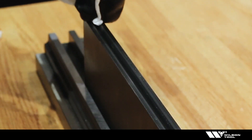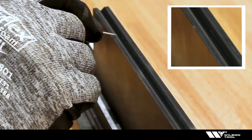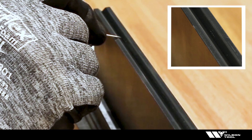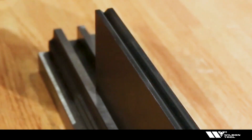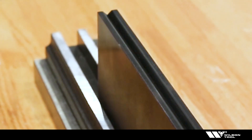We're still left with a little bit of buildup. That one spot can be taken away with our lightest scotch-brite in the white color. A couple of passes, then wipe any residue left with the rag again, and you can see we now have a perfectly clean die.